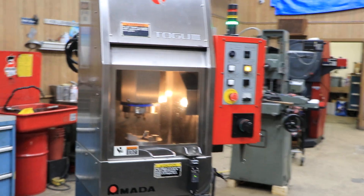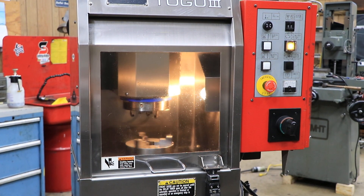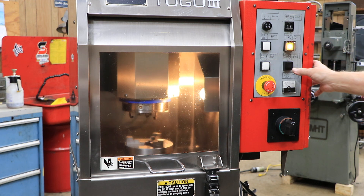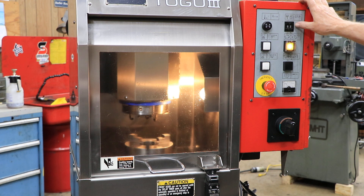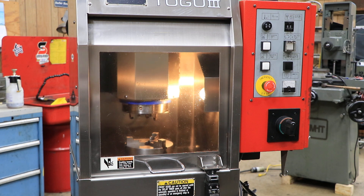Air is being blown out now and the spindle is coming down very slowly looking for the part — you can't really see it moving. I'm going to stop the cycle because it's never going to find a part. Once it realizes it has touched the workpiece, it actually backs up nine or ten thousandths, then goes into a fine feed rate and takes off another two thousandths. When I hit the stop button, everything stops and the head goes back up to its start position, and the light comes on to indicate we've stopped the cycle.